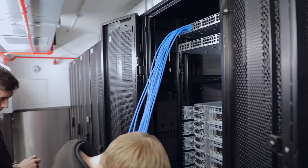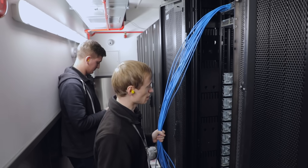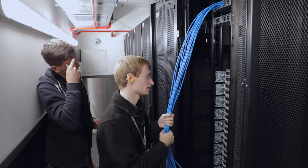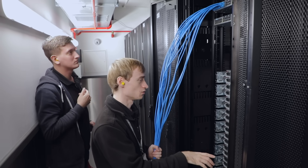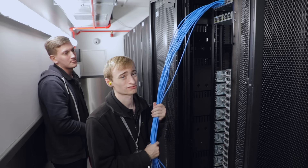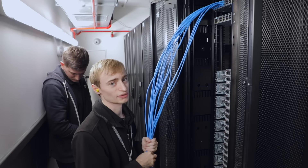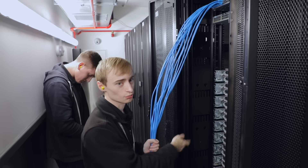You'll notice I'm actually going to take the cables down this side of the tray. We've also got power cables to go in as well. The reason for taking it down this side is there are some fibre cables to go in. We like to keep those separate — it means that if you've got a random engineer pulling on a piece of copper, they're not also pulling on fibre. You don't want to bend a fibre accidentally. There are also some U-space PDUs to go in rather than our zero-U ones, so we've got more tray space this time.